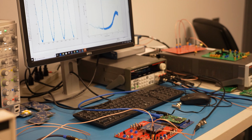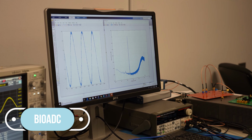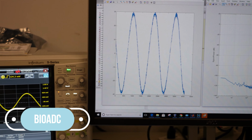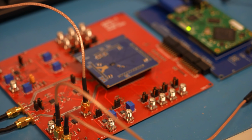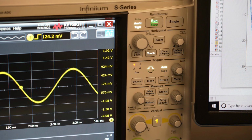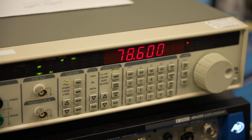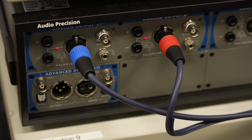An analog to digital converter, also known as an ADC, is a key block in sensor front ends. Recently, the trend is towards direct digitization in wearable applications, requiring extremely high dynamic range and linearity ADCs to digitize biopotential signals in the presence of large background signals, such as interference or artifacts. This work uses a voltage-controlled oscillator to time encode the input signals, enabling supply-agnostic signal processing and significant power reduction. This work achieves state-of-the-art performance.